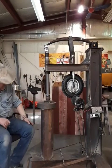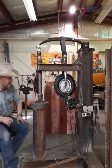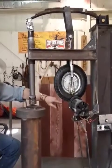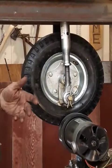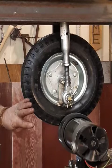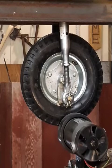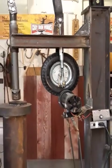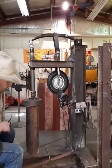How it works is the motor rocks into the tire. And because it's a DC motor you can reverse the direction of the motor just by switching two wires — it'll run either way. And because it's a DC motor, you can run it on a potentiometer. So when you step on this, it just rocks the motor into the tire, and that's what runs it.